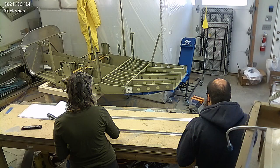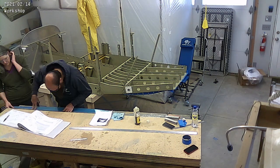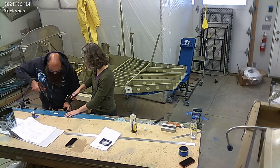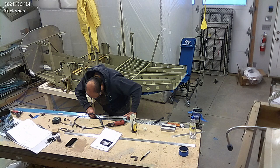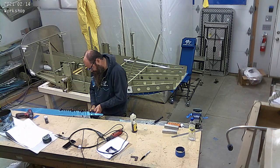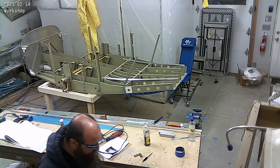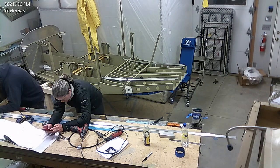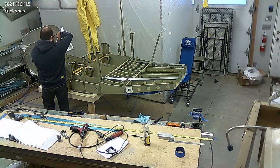Next, the gear weldments. The gear weldments got done, shaped and fit, and we're working on the longerons — the eighth-inch pieces of angle that are bent into specific shapes. They basically transfer a lot of the loads in the airplane and stiffen up the skins into the right shape. You can see the blue template that defines a lot of the curves. There are two curves, two different twists, and four longerons for the front of the airplane — two per side.